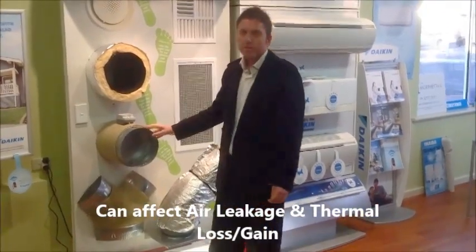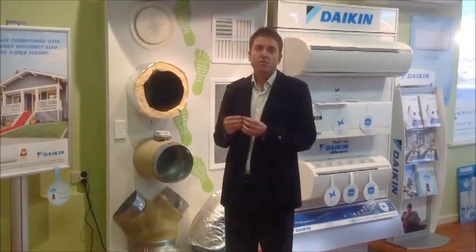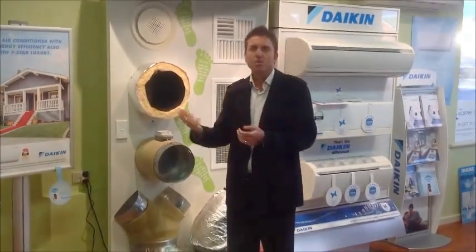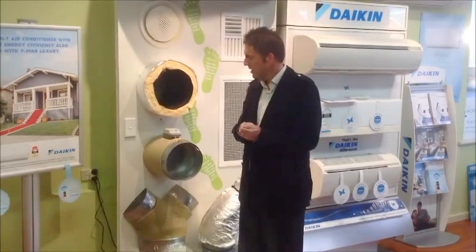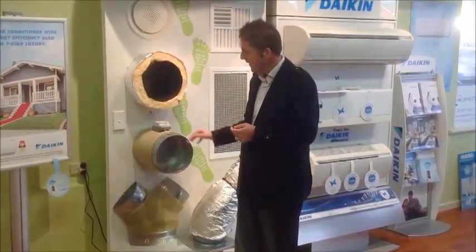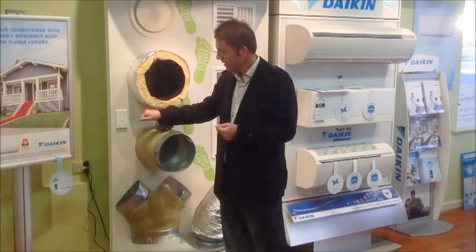In relation to your zoning — you may have seen on the wall next to the main control panel that there is a switch plate, or buttons and LEDs, that allow you to turn off and on and isolate different zones in the house. It might be bedroom one, bedroom two, living, etc. For every one of those switches or buttons, you have a motor up in the roof — again, something you don't see. It's this motor that actually drives a cylindrical damper that opens and shuts, isolating the airflow to the room.